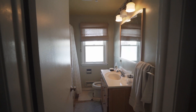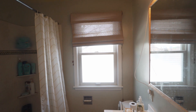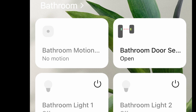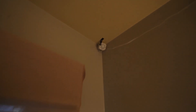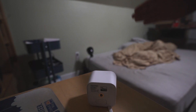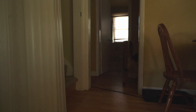Now that the motion sensor was added, the next challenge was to figure out where to put it. It came down to two locations, which were the back corner and the ceiling. The corner next to the door was a good spot too, but because I thought sunlight coming in through the window could tamper with the infrared light picked up by the motion sensor, I didn't consider it. For the next several weeks, I tested the motion sensor in both locations using automations I built directly in the SmartThings app and later using WebCore. Whenever the motion sensor status changes to motion or no motion, a green LED light will flash. In the app you can also modify the sensitivity of the sensor between minimum, normal, and maximum. The sensor has a field of view of 120 degrees and a range of 5 meters, and from my experience these claims were consistent with my observations.